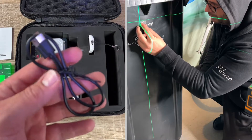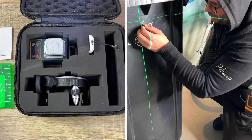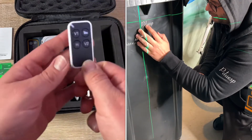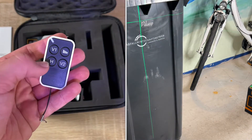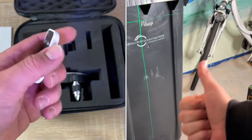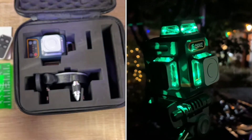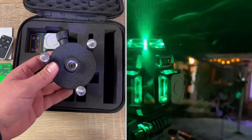It's really easy to operate. To switch on the measuring tool, slide the lock into the open position. Immediately after switching on, the tool sends out one horizontal beam and two vertical beams, with automatic self-leveling range of plus or minus four degrees. Once leveling is finished, the laser beams stop flashing and the indicator glows — then you can start work. For manual mode, push and hold the power button for approximately three seconds.